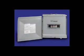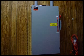This high-capacity transfer switch is harder to install because the electric meter must be pulled and heavy service cable must be rerouted and terminated at the switch. If you happen to have a service disconnect at the meter, it won't need to be pulled.